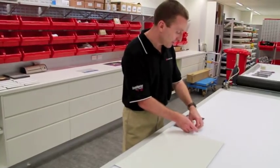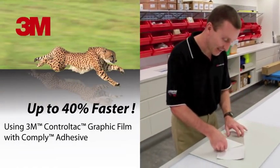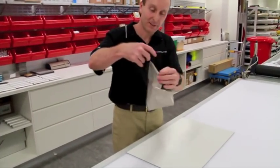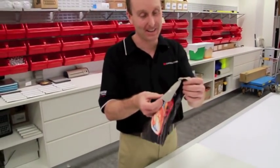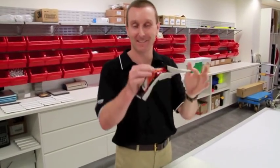Now have a look at the same film where we've still got ink solvent trapped inside it, which makes the film very soft. You can already see that it's starting to curl up and wanting to stick to itself. It won't pull apart, and as soon as it touches the surface it wants to stick down. It very quickly turns into a very soft mass — it's kind of like chewing gum, very soft and stretchy, and very difficult to work with.